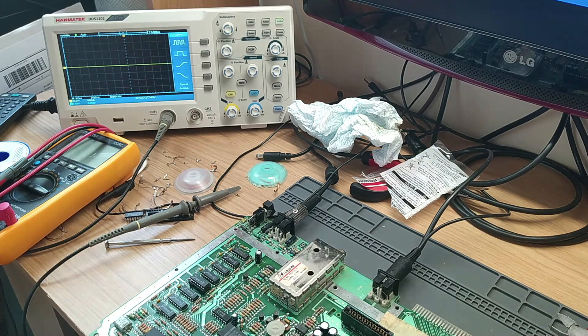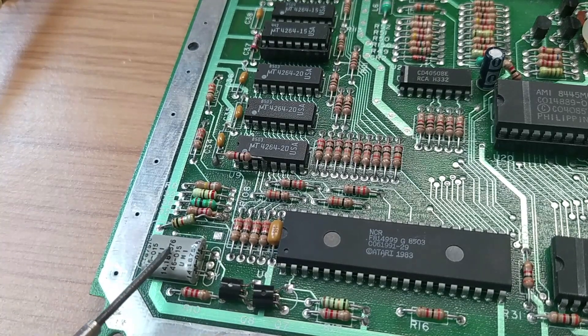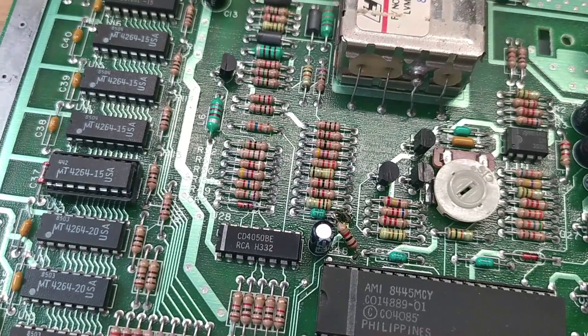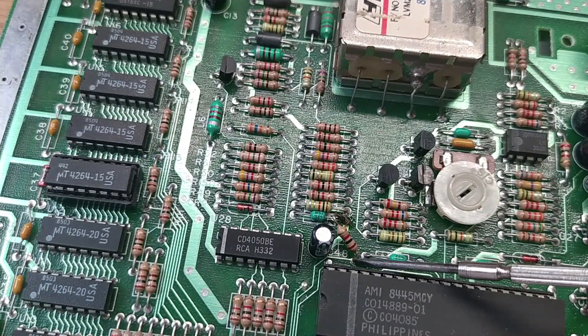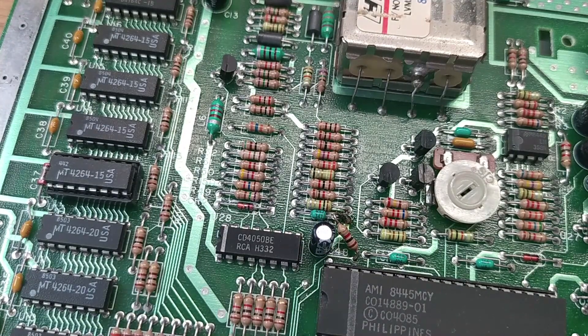These boards are so nefarious - very, very tricky. I'm pleased to say that, as unsophisticated as some of the troubleshooting may seem, I'm not alone in being driven insane by some of these boards. We've got manufacturing faults and all sorts of strangeness. Look at the amount of bodges - there's a cap on the output from one of the transistors from the main crystal that was supposed to go to this pad here, but it's been re-routed to the end of this resistor. There's also a resistor going to the end of this cap coming from the Freddy chip. These boards show this whole design is transitional, ironing out bugs with little patches until they more or less got it right with the XE.